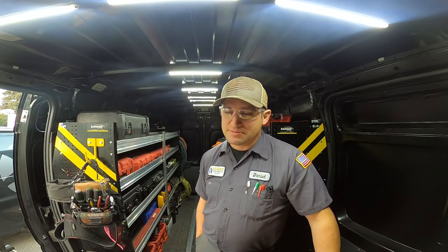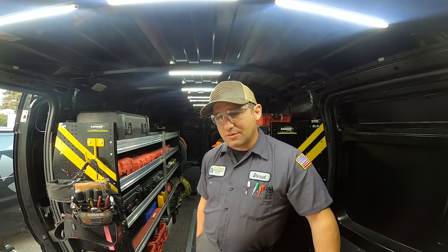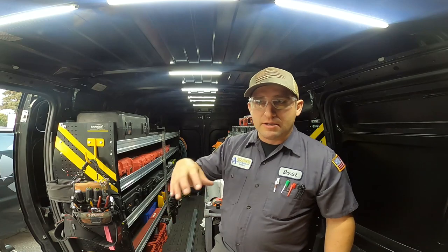So today I got something special to show you. We got a BAC condenser that had a pretty catastrophic failure, and I'm kind of disturbed by what happened. So I'll show you what's going on here. There's a motor that had a failure. The motor fan blade assembly dropped out of the stator. The rotor fell off the stator somehow, and it fell into the coil and destroyed the coil on this Canadian BAC condenser, a Trillium style condenser.